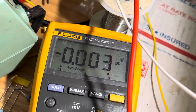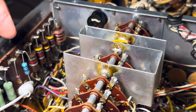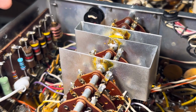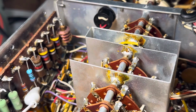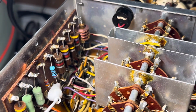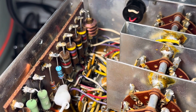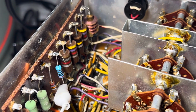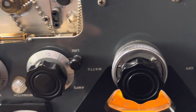The relay closes that. So they have a voltage divider which is consisting of this resistor first, and then they have 2 more of them in line. The finals basically get their bias between these 2 resistors, and that goes to the finals via a choke. Anyway, to make this work right, and I'm sure it's not really right, but to make it work satisfactorily, I put a 2K resistor in there and took out the 1K. And that gives me sort of a reasonable rendition now. And let me show you what I mean.